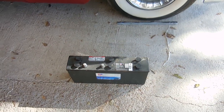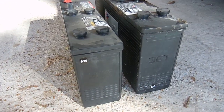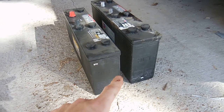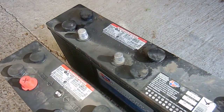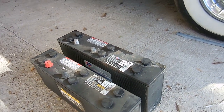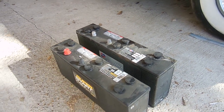This battery — I feel like it's bigger than the one I bought. Here's the difference between the batteries: it's about an inch taller. This one is a 3EE and that one is a 3ET. Basically they're for farm and commercial use, like tractors and stuff. I remember buying this battery because it wasn't much more for a few more CCAs — this one's 500, this one's 400.